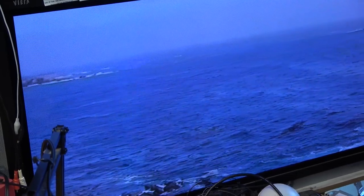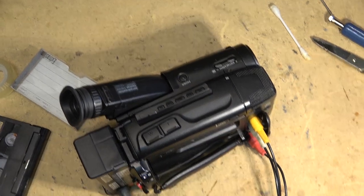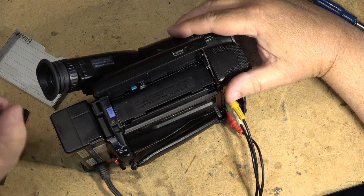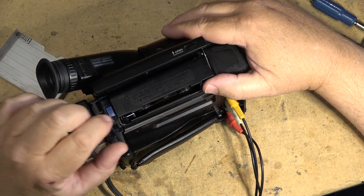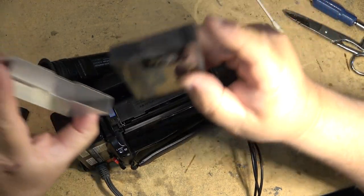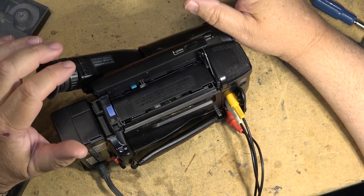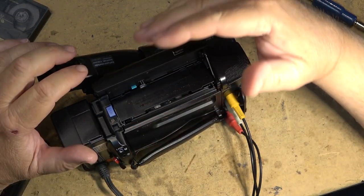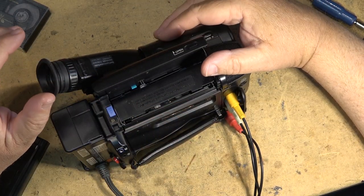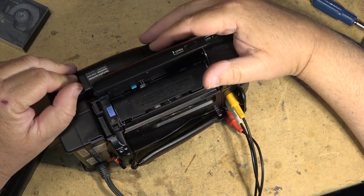Thanks for watching. And remember, when you see one of these camcorders, the biggest problem with these camcorders is that little circuit board on the bottom, the connectors on it. That's the biggest problem. There's all kinds of strange problems. Some of the symptoms are, well, it will open and close when there's no tape in it, but when you put in a tape, it will just sit there and open it again. It will not retract. That's one of the symptoms.